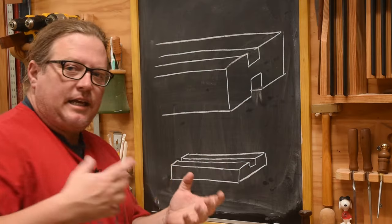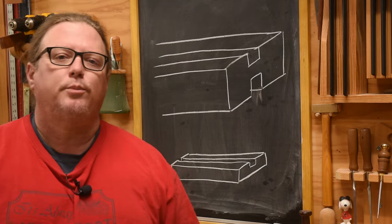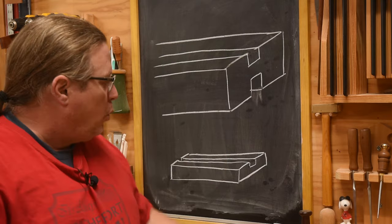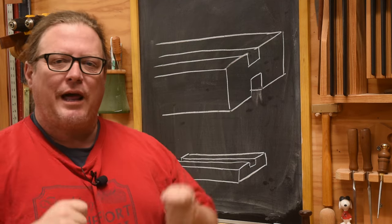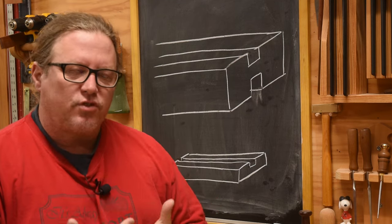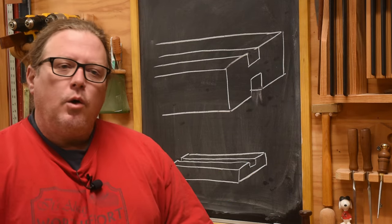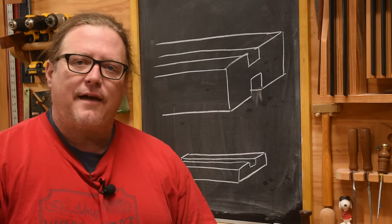Now, in this test frame, what I'm going to be doing is putting a groove in all the 2x4s I'm putting around there, and the wireframe will fit in that groove. I'll make it just a little bit wider, so there's a little bit of rattling involved for some free play right there. And I'll probably go about 3/8 inch deep, which is only about 1/3 of the way through a 2x4, which is roughly 1.5 inches.